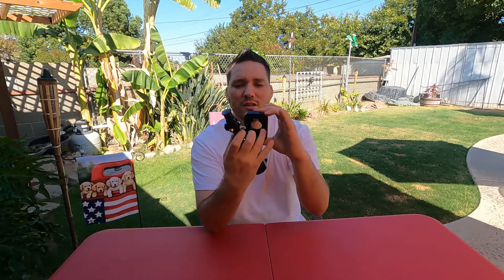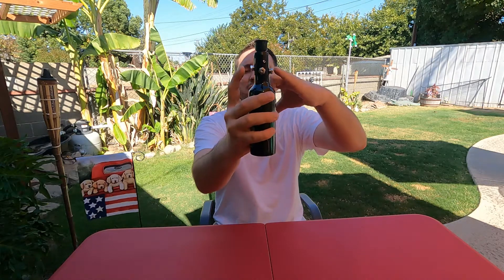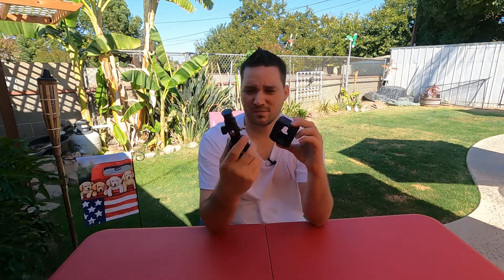There are a few sections in here. The large section here is for your gauge — it's going to go in like this. The section on this side is for your 5K blow-off burst disc. And then on this side you're going to have the 1.8K burst disc. As you can see, they're offset, so your design is going to have to be offset. And over here you have your fill spout or quick disconnect on this side.